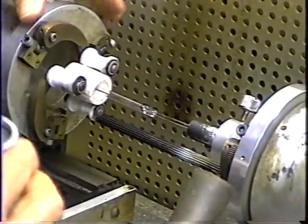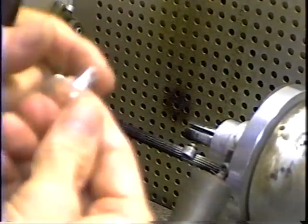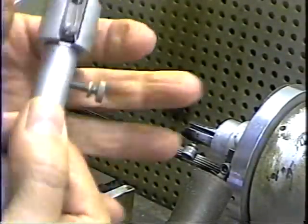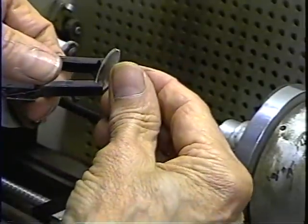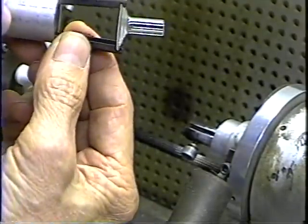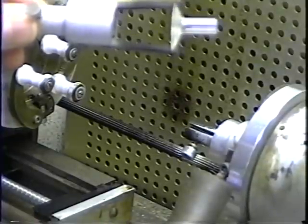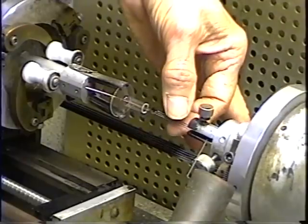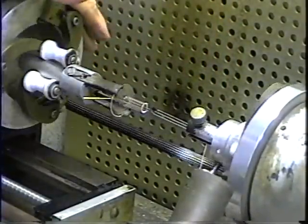I'm going to look at that with a magnifying glass to make sure it looks good. Next, we're going to do our flare — I'm going to make the seal on a flare. This is the flare we made just a while back. The flare holding tool: we just have a piece of aluminum with two spring-loaded arms, and a little notch cut in the end so that when we tip the flare in there, it just holds it. They're little channel-shaped pieces of metal made on a sheet metal brake. We have our flare mounted in the flare tool and our electrodes mounted in the wire holder. The lathe holds them perfectly in alignment while we work on it.